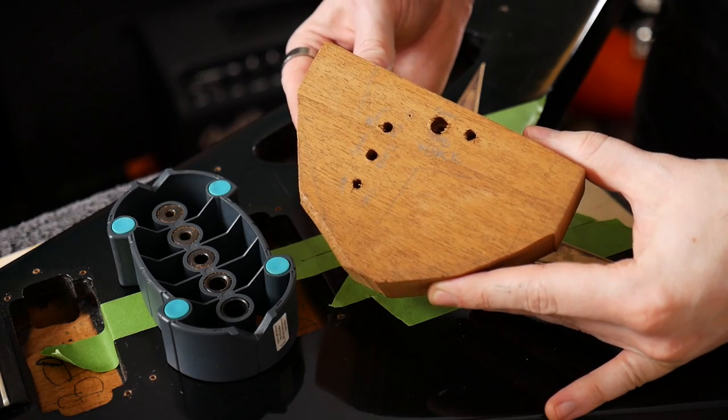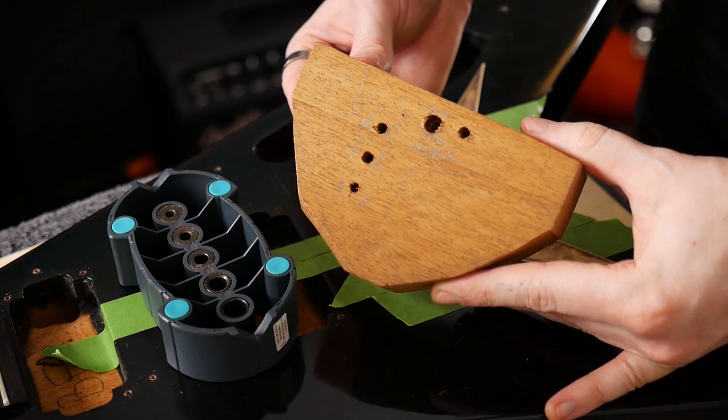This is a drill guide with steel collets which have holes the diameter of standard drill bits, and this will hopefully guide the drill bit and keep it perpendicular to the workpiece. But even with this, and with drill presses to some extent, the material that you are drilling through can deflect a drill bit, keeping it from following a straight path. Once again, I did a number of tests on a scrap piece of mahogany the same thickness as the mahogany body of the guitar. Every single test punched a hole true through the mahogany block, exiting exactly where it should. So my technique worked, everything was looking good, and I was feeling confident.